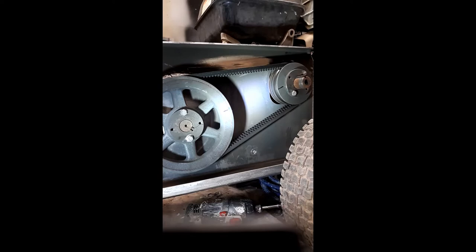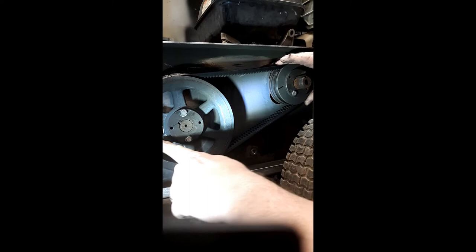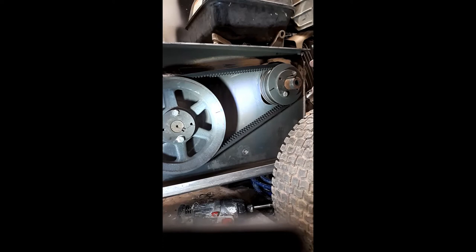We're going to rotate the shaft on the engine and watch the mark on the engine versus the mark on the pump. Keep in mind this machine at full throttle produces 4,000 PSI. So we've got the mark here — we rotate it — that's one full turn on the engine, and our mark on the pump is only over here. Let me turn it a bit more so you can see the pump mark. Now we keep rotating and — boom — they're lined up again.